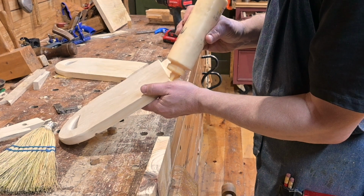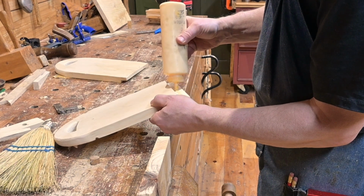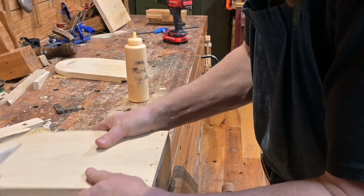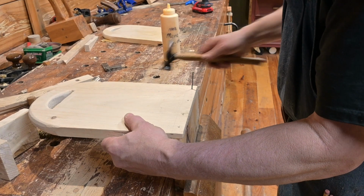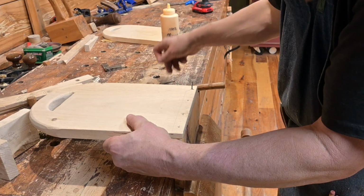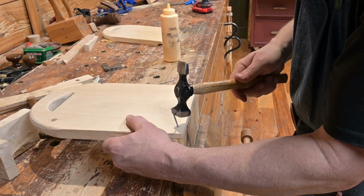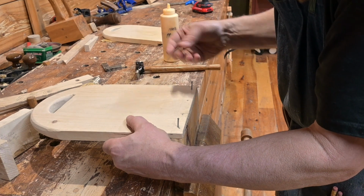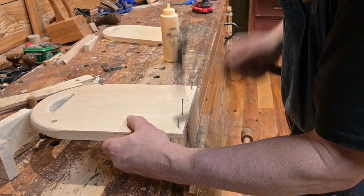Tom glues the short sides to the Trug bottom, placing the glue into the rabbets. In this rustic Trug, nails will also be used. He's already pre-drilled the nail holes before gluing. Then just simply pounds those nails in. The pre-drilled holes assist in keeping the nails from driving in crooked. He has the bottom clamped in the vise that he made for his workbench.